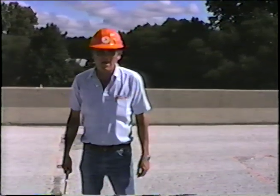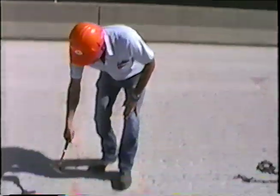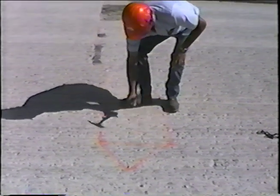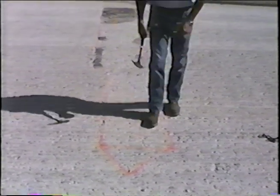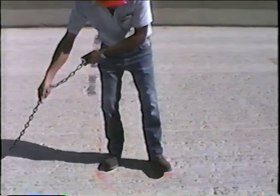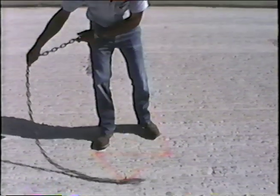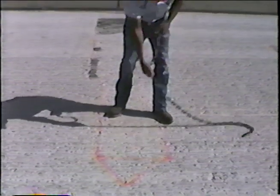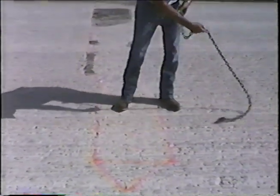One way to check a deck for deck prep areas after it's been cleaned is to take a hammer and tap on the deck. The more widely used method is dragging a chain across the deck and listening for the sound. When you hear a hollow sound, that's the area of deck prep.